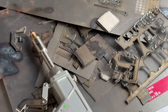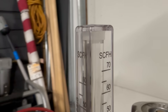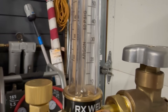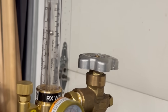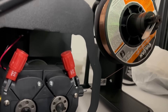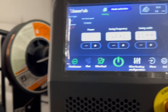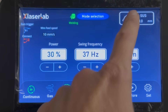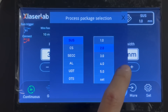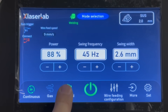It was definitely fun to use. Now when adjusting the gas — whether it's the nitrogen or the air compressor — if you're blocking the flow meter you won't see the flow, so make sure you turn on the gas on the machine first and then you'll see your flow. I'm doing about 50 PSI because I'm going to start welding. I'm using Harbor Freight Vulcan 0.030 wire. On the touchscreen you click the upper right to select your material — I'm going with steel at 2 millimeters — then choose continuous or pulse, set your gas, and configure the wire feed.